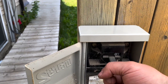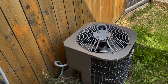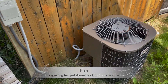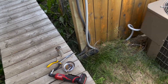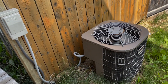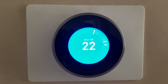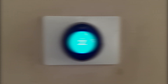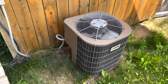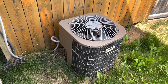Let's see if we let the smoke out of the wires. There we go — back in business. Put a new run capacitor in and I am good to go. It's actually really good because it's 26 and a half degrees in the house, which is brutal. So there you have it — nice to have the AC back up and running. I got the dual run capacitor off Amazon for like 25 bucks. Easy fix.